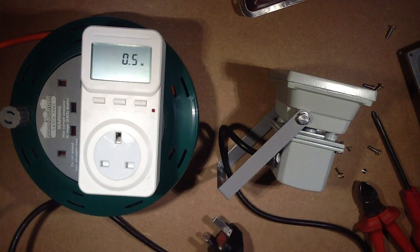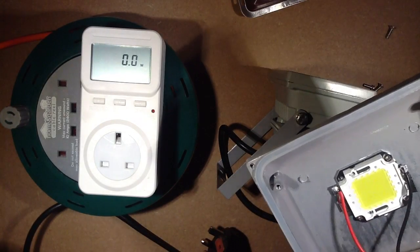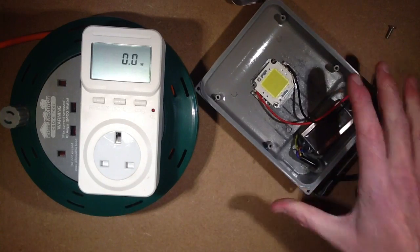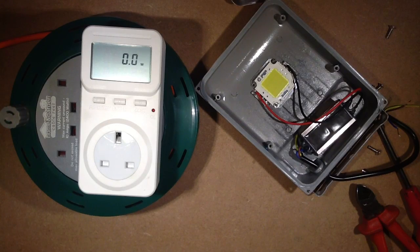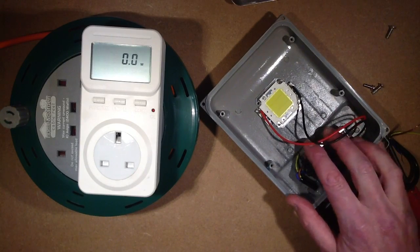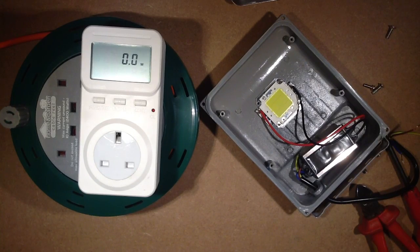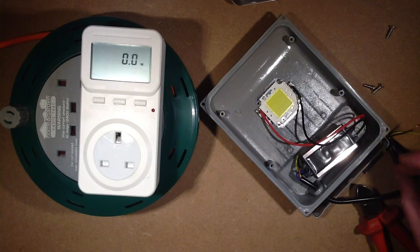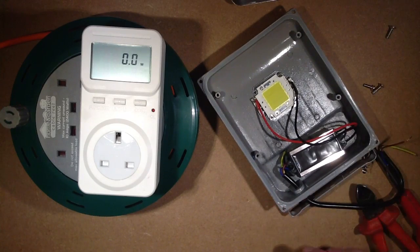This pretty much means that all the lights that I've bought recently — particularly in this flat style — seem to be cheating on the power ratings. The annoying thing is the other one that was showing proper 20 watts — the green one — I bought that from China and it was really quite cheap; I bought it to take to bits. All these other ones were sourced from UK suppliers, so it's a bit disappointing. I just thought I'd get them from UK suppliers so they arrive quicker. But I'm still going to put them up — there's not going to be as much light as I wanted. I suppose I could put new modules in. I think I'll send a wee message back to the seller, but I'm not sure they'll actually give a shit — they probably don't even know they're getting ones labelled 20-watt but actually fitted with 10-watt ballasts in them. Well, that concludes this video then, on a sour note of LED disappointment.